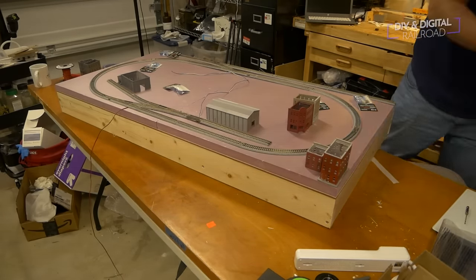We then connect the white wire to the black switch feeder and a green wire to the negative terminal jack from the DC plug. We use the heat shrink tube method to secure it all in place. I am using different colors so that it's easy to distinguish which one is the main power and which one is the power that goes to each individual light. The white then attaches to the red screw terminal on the bus, and the green attaches to the black screw terminal. We then plug the power into the terminal jack, and we're done with the lights.